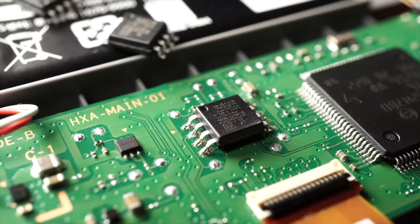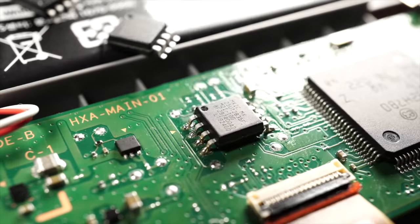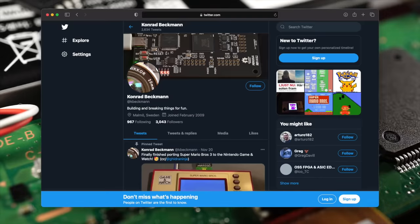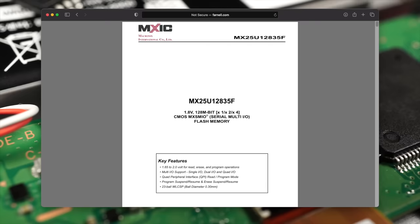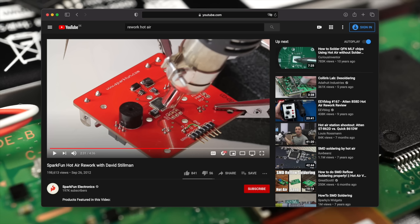Also on the hardware side, DNA64 and Conrad Backman — who I hope you are following on Twitter and YouTube by now — and me have replaced the original flash chip, which only has 1MB of storage, with a larger 16MB one. We found that the Macronix MX25U12835 is both compatible with the stock firmware, while also being fast and easily usable for homebrew development. These flash chips cost less than $3 and are really worth the investment, though note that to put it in you will need some experience in reworking PCBs and equipment such as a hot air soldering gun.